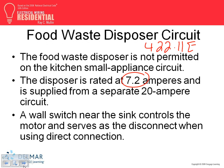if it's an appliance rated 13 amps or less, it's a 20 amp circuit, no question asked. If the appliance is 13 amps or less, are you there? It says non-motor operated. It would be a motor operated appliance. You're right, non-motor operated appliances.